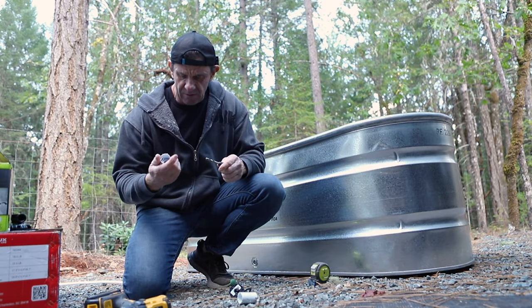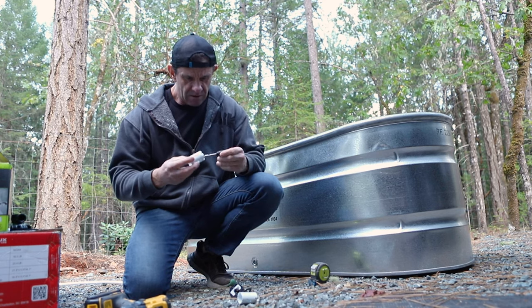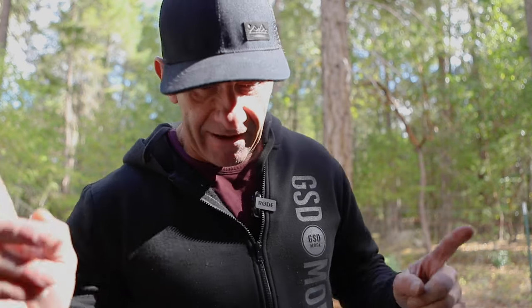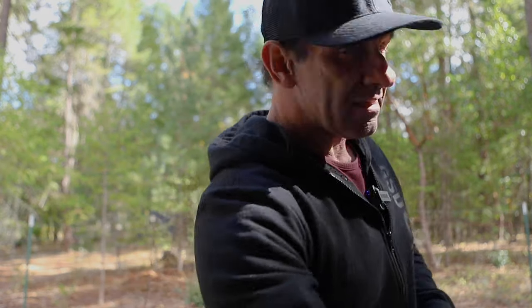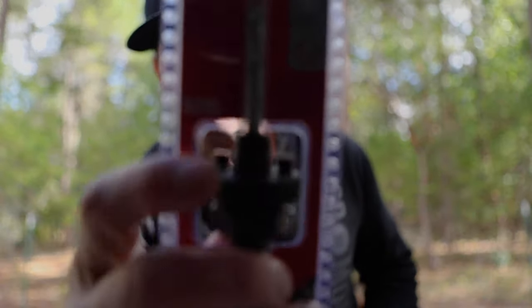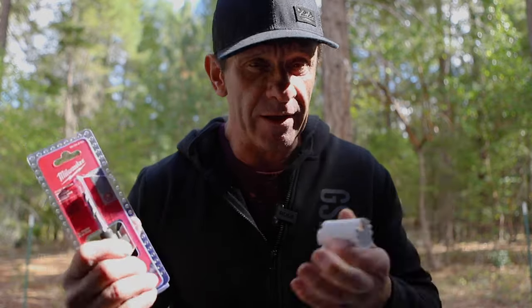You can see it's taking just a little longer than an hour or two like I thought. I just didn't have what I needed. If you have one of these things and you need to make a 1-3/8 hole in the side of a metal tank, you need something called a quick-change hole saw arbor. You can tell because it's got these two little do-bobbies here so that it will work with the hole saw. I got this now, so I'm going to make some holes and hopefully we can get this thing working.